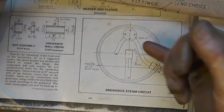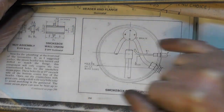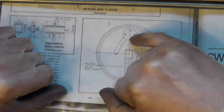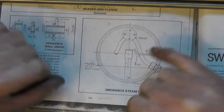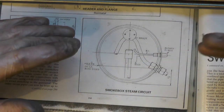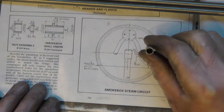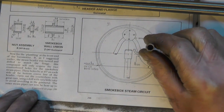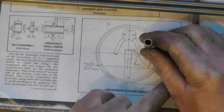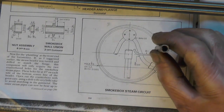So this is in the smokebox. I've got two superheater tubes coming up from the firebox into the smokebox, and I've got to connect them - one to the cylinders, one to the wet header. I'm going to make the standard configuration alongside a non-superheated configuration, so I can find out for myself whether superheated steam on a Sweet Pea is best or not.